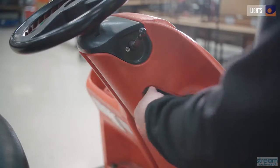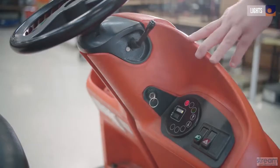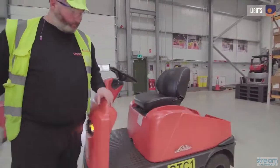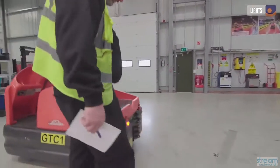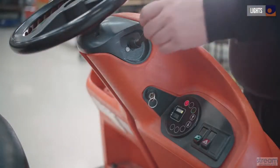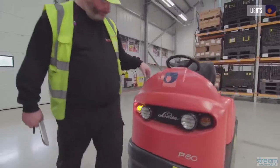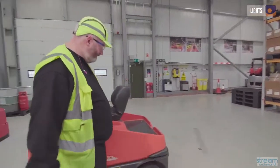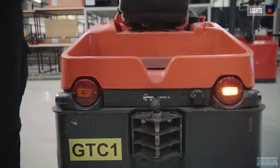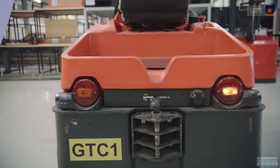Next, put the vehicle into reverse so they can tell you whether the reversing light is working properly. Lastly, check that the indicators and warning lights are working at the front and back of the truck. As well as by getting someone else to help, you can also check the rear lights and indicators by stepping off and walking to the back of the truck. And, depending upon lighting conditions, it's possible to check that the brake light works from the spill behind the truck.